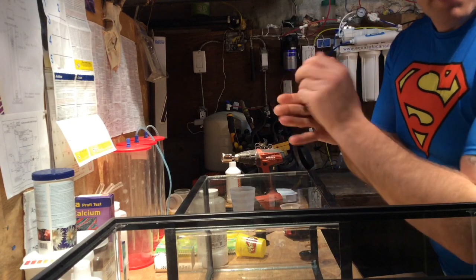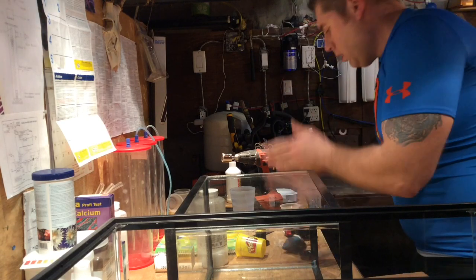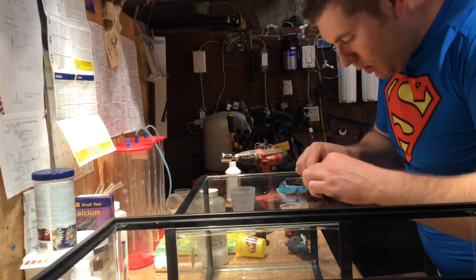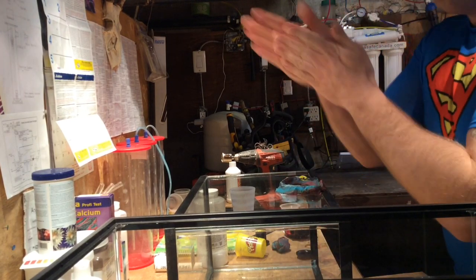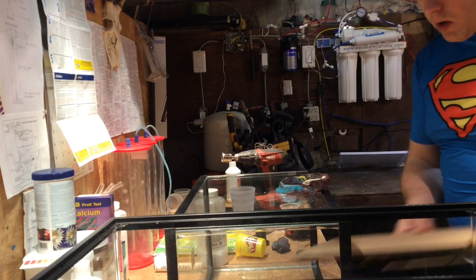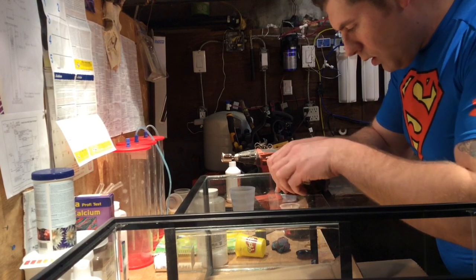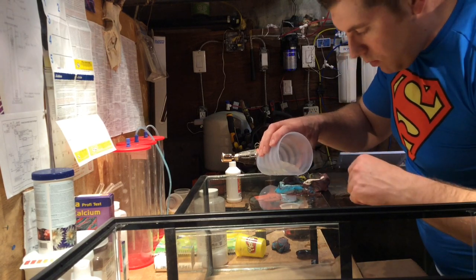Next thing, you're going to take your kids' Play-Doh or plumber's putty — but I got no plumber's putty today, so we're going to improvise. This one's been used pretty good, all mixed full of different colors. We're going to roll it out so we can make like a moat to keep all the water in like a dam. Push that tight around where you want to drill so you can keep a good seal and keep all the water in. Keep it tight all the way around the edges and add some water in. I suggest you keep a towel or a piece of cardboard underneath because the glass that falls through — you don't want it to fall onto the front of your glass and crack it.